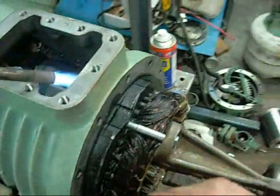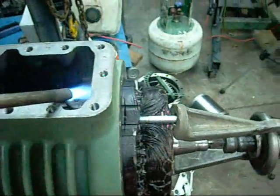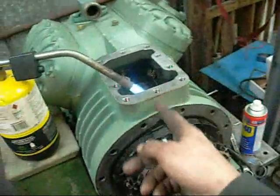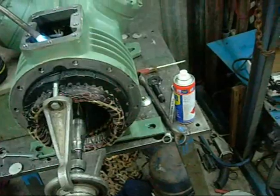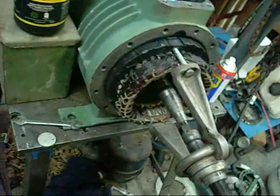I'm using a wheel axle hub puller as well, getting that pressed in with a hydraulic press without pulling all the laminations out. The other option is just to cut it with a 9-inch grinder. I know there's probably a machine designed specifically for pulling these stators out - I can't figure out how they really do it otherwise.